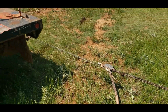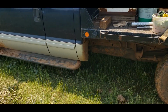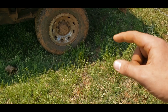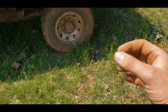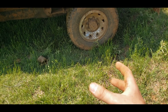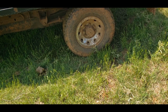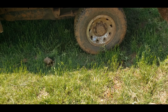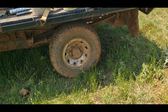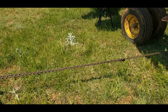And the reason the pickup is parked like this instead of straight on is because, and I don't know if this is every transmission or not, but on this 4R100 that's in here, the park is a pawl, which is basically just a piece of metal, and it's like a slotted disc inside of that transmission. When you put it in park, it shoves that pawl through one of the slots in that disc, and that's what keeps your wheels from turning when you're in park. So in theory, if you yank on this pickup too hard one way, forward or back, while it's in park, you run a very severe risk of shearing off that parking pawl, and then your park no longer works, which is bad. So we do it this way so that we're kind of dragging that tire, and no, the tire's not going to come off that bead or anything. We don't have to worry about that. But that's why I don't hook onto this straight on, just because that transmission doesn't need any help.